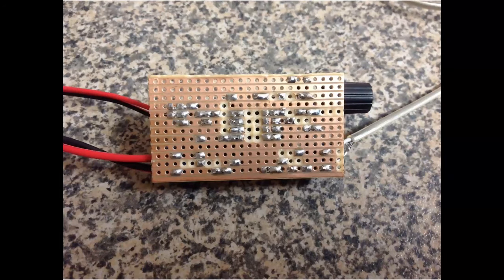I guess a lot of us have had a go at this. If you haven't, it's pretty simple, really. But you need to remember, if you're going to make connections between those traces, then make those connections. I used to leave them all to the last minute and then forget one and then wonder why it's not working because I've got an open.